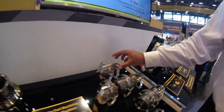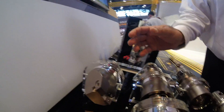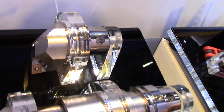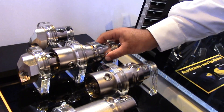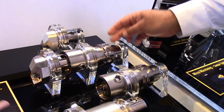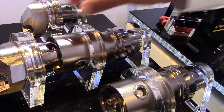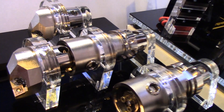It's also nice about the 63 system — we've had questions about what it's going to do with your existing KM system. Well, if anything, it's going to enhance it. This is a standard KM4X63 static turning head. But what we've done is opened up our KM product line to be incorporated with the KM4X line. This is a KM4X63 to KM63 adapter. We have probably about 2,000 KM63 tools that we can now incorporate in the KM4X line.